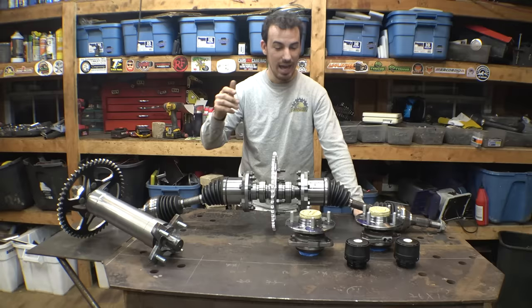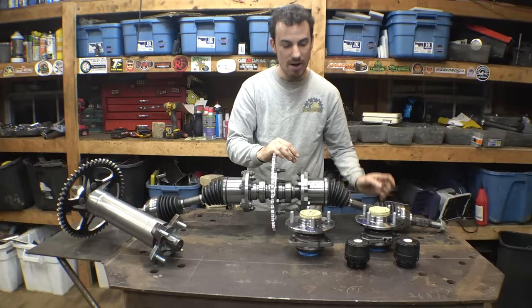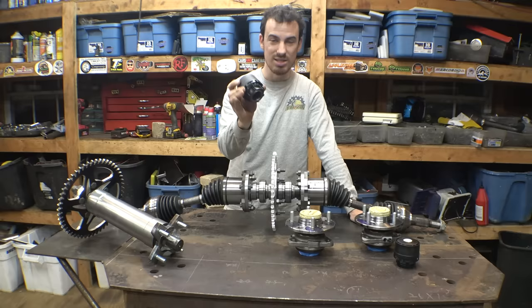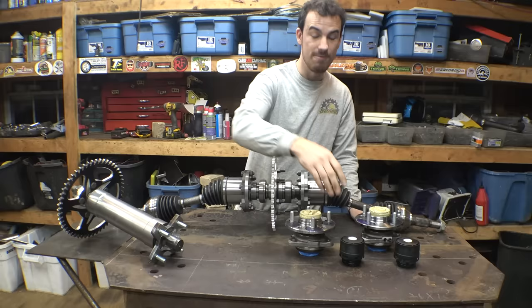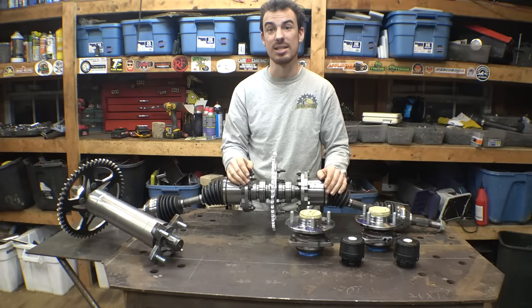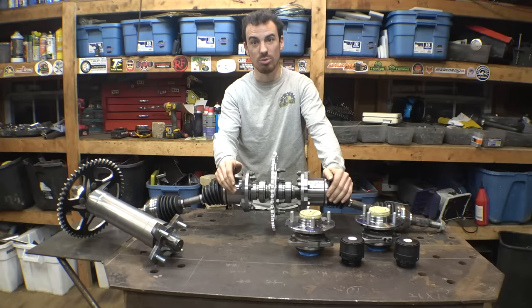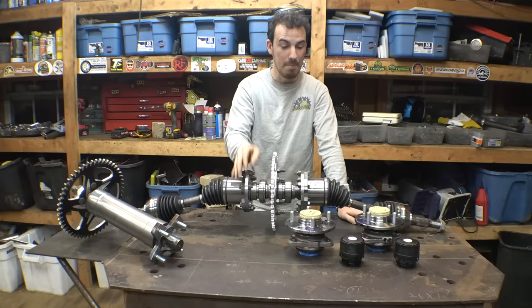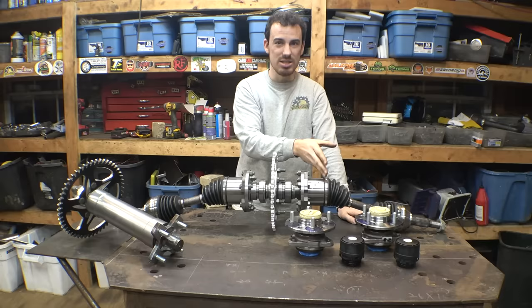the hubs lock. And I found these, and in my research, I did find that on older Ford Rangers, these are kind of problematic. They don't work that great, and people actually tear these off and replace them with just manual lockers. But it's not this that's actually the problem. It's actually just the vacuum line that's going from the engine to these just rots out and falls apart, and that's what causes these to not work on older Ford Rangers. So as long as we use good vacuum line and they don't rot out, these should work just fine. Originally I was looking these up, and I'm finding a lot of information on how to bypass these and tear these off. Like, why are they such a problem? But apparently it's just the vacuum lines.